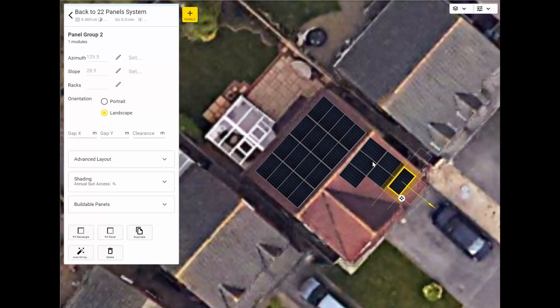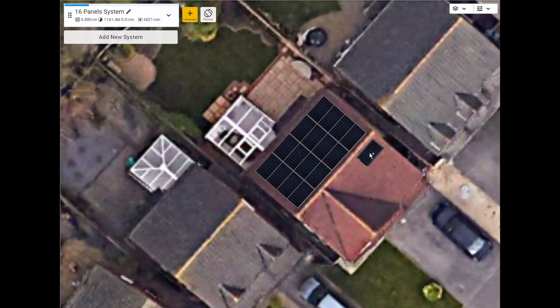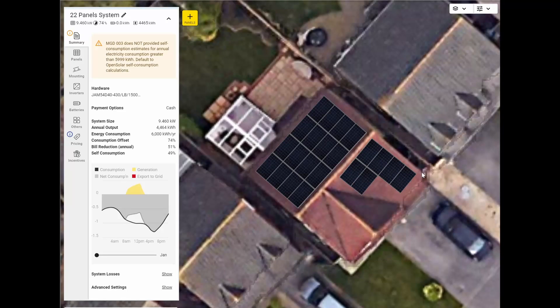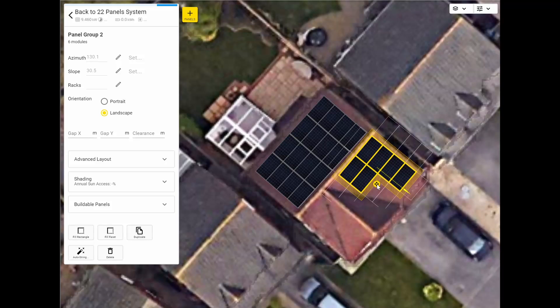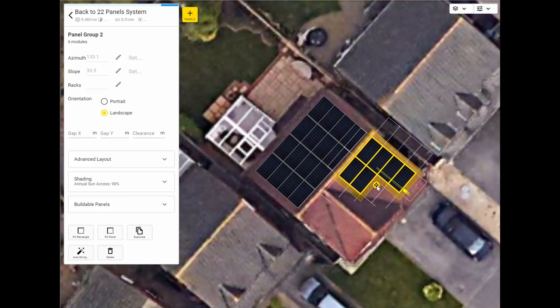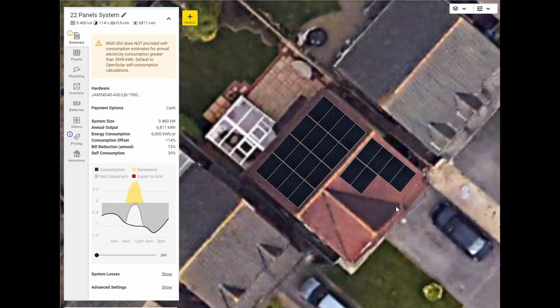Turning to the front of the house, aesthetically five in portrait and one in landscape looks a bit weird. So let's take these out and manipulate this — one, two, three, four, five, six — keeping them all in landscape looks a little bit cleaner with the same orientation, and it looks like we should have enough room. We're a bit close to the ridge, and if I bring it down we get close to the valley where the front gable meets the pitch roof. But this is approximately how I've determined how many panels I want to fit on the roof.